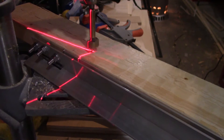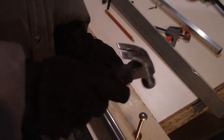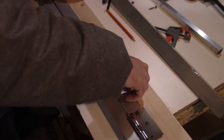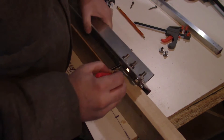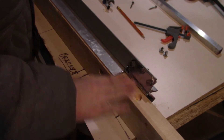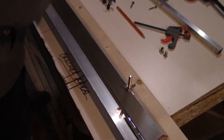In order to keep the brake level with the table, I countersunk the bolt holes from the bottom. I then secured the bolts from the top with the nut. While I had the forstner bit and the drill press, I also drilled out the areas in the way of the second piece of aluminum falling flush with the rest of the brake. The third piece of aluminum is then installed and held in place with a couple of washers and wing nuts.